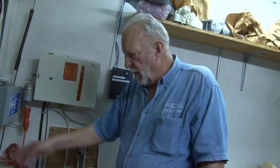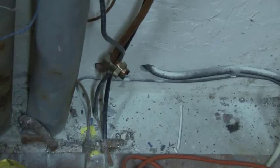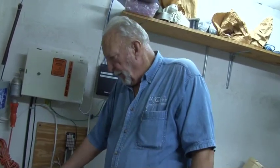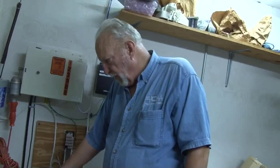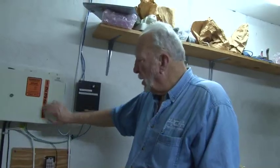The panel ground is now connected with a split bolt to the strip of copper that's basically a static shield. That is going to be removed. It'll be on this ground bar plate with a separate conductor back up to this ground bar.